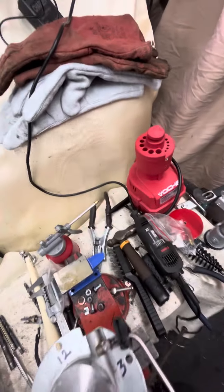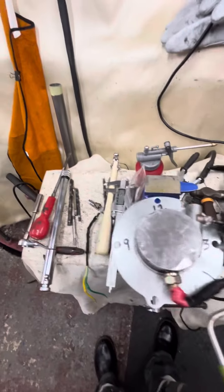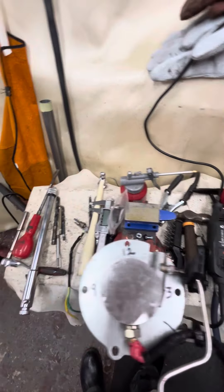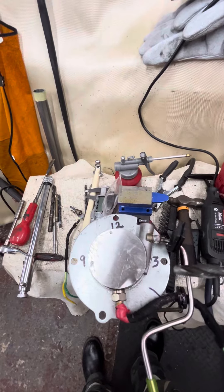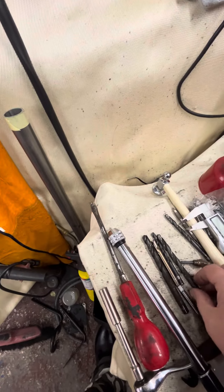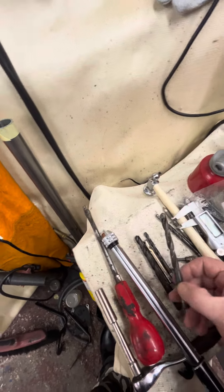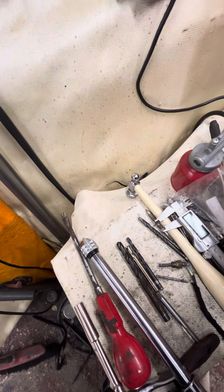You're going to need a huge selection of drills and a drill sharpener if you've got one. This casting — I don't know what it's made of, some form of cast iron — really kills your drill bits, so you're going to have to keep sharpening them bit by bit. You want to come up to — if you can find some old imperial drills that measure up around 9.25mm.